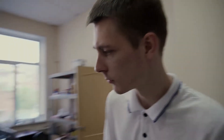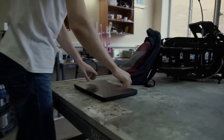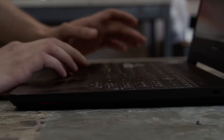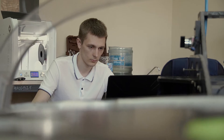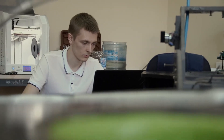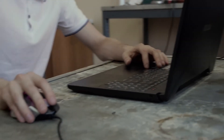I've got an idea. Every year new requirements appear at different AUV competitions. The tasks become more complicated, so it's necessary to modify and re-equip the AUV every year. This is a rather time-consuming process. To simplify this, we decided to make the vehicle a modular AUV. The AUV hull consists of two elements: a carrier and a payload module. The carrier is an unchangeable part of the AUV that can function autonomously and contains all the main elements — thrusters, batteries, electronic units, and all the main sensors. The payload module is a changeable part that will be constructed for a specific competition or mission, and may include, if needed, a manipulator, marker dropping devices, sonar equipment, etc.